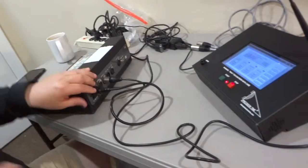If for some reason the clock toggles backwards, you can go into the settings, clock configuration, and the SSR switches 4 and 5. If they're off, switch them to on, and that will make the clock run the correct direction if it is running backwards when you do this initial setup.